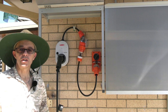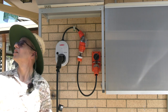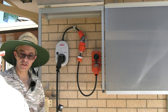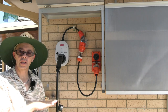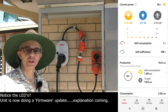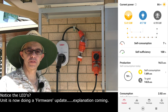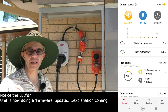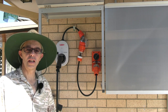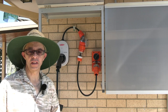Before plugging in, we were basically hitting our 5-kilowatt feed-in limit — not using much in the house, pumping up to 5 kilowatts to the grid, and anything over that five was wasted. The 3 kilowatts between 5 and 8 — the capacity of our inverter — was wasted. A screenshot later will clearly show that excess energy, including the 5 kilowatts going to the grid, is now going into the car instead. This charger tracks the excess solar very closely — if a cloud comes over and PV generation drops, this charger drops with it.